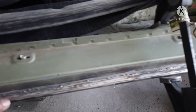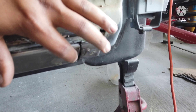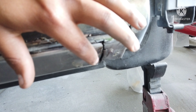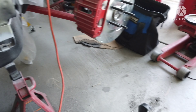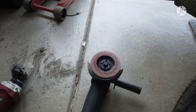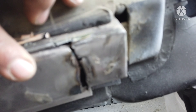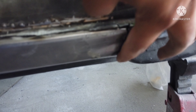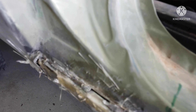Get all that welded in — a whole bunch of studs. This corner kind of dented in a little bit; won't worry about pulling it out because this gap is too much of a gap. The cut-off wheel ran out of disc, so I'll use a flap disc to cut the rest of these welds out. That gap is too much to try to weld, so I'll weld along the top, and here will be fiberglassed in. Same thing with back here, but along the top right here I'll still try to get some welds in there.